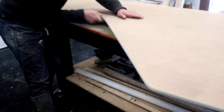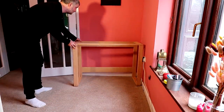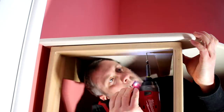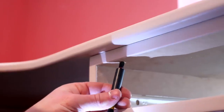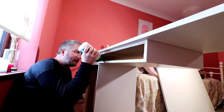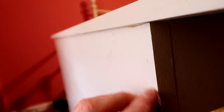After adding round-overs, sanding, priming and painting in the same way as the drawer boxes, I started getting the old furniture removed from the room and brought in the new components. I used screws — plenty of them — to secure the desk frame to the desktop to add rigidity and stop it sagging. I'm not using any glue here as I want to be able to dismantle the desk in future if needed. I then positioned the drawer component and secured it to the desktop at both front and back. Once secured I added the back panel to support the cantilevered drawer box, using polyurethane glue held in place with a few brad nails until dry. The nail holes were later filled, sanded and painted.